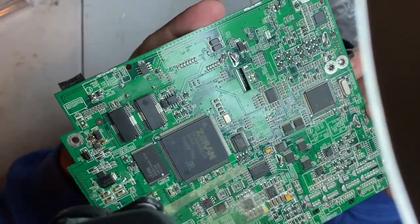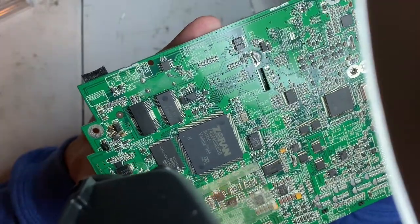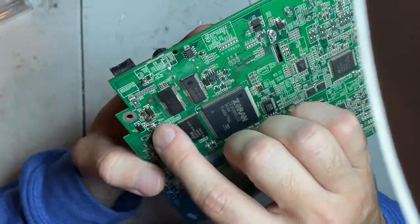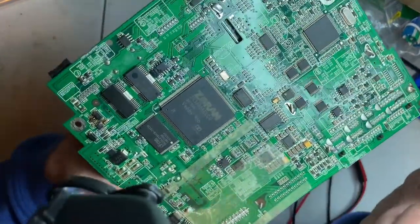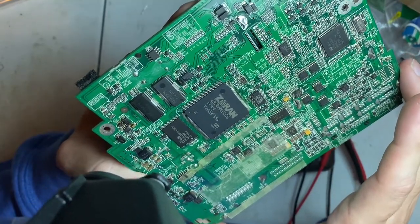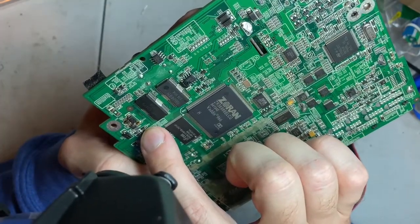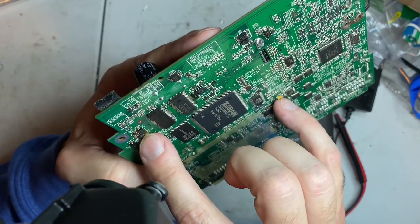Okay, so for part numbers, it kind of sucks because all three of these diodes here are different part numbers. I would almost have to take a picture and blow it up. It looks like it's a 5D, or 50D. I'll go with 5D, because that's the same as D39. And this has got an F on it, so it's that for now.